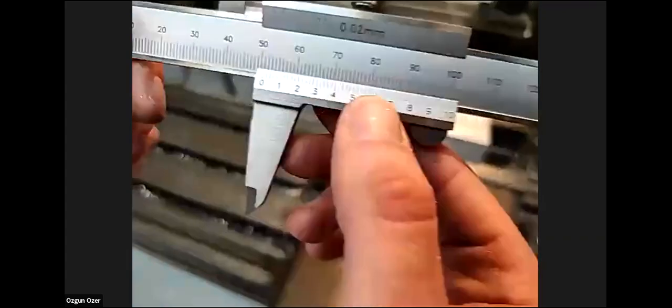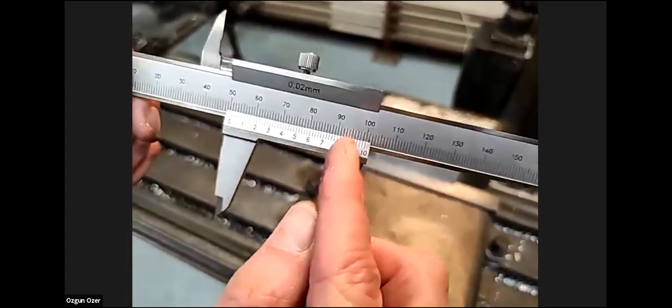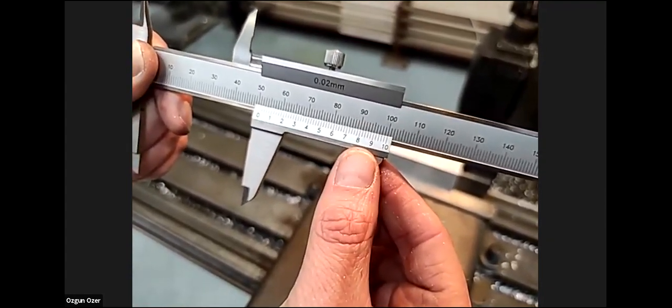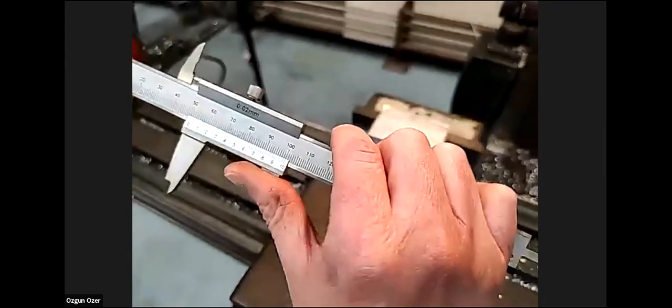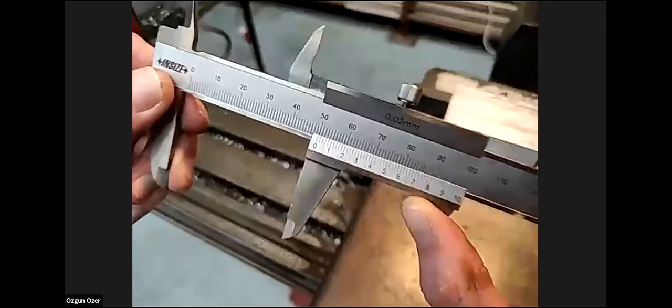It's not quite 50.9 because the 9 doesn't line up with the top scale. I would say that is 50.8. Yes, 50.8. Okay, I think Furkan, you said 74. You should look for the zero where it matches first and then go for the second digit. Yeah, start from the zero. And that will give you 50.